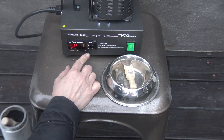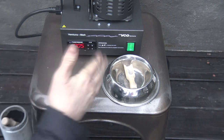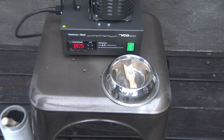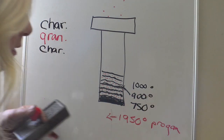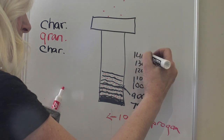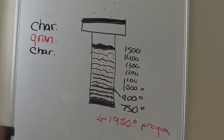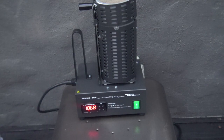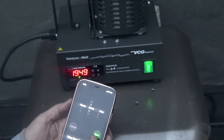We just completed our first three layers at 750. Now I raise the program to 1950 — press P and use the arrows to set it to 1950, then press P again to set the program. I'm at 806 now; I'll wait until I get to 900 and repeat the process. I'll repeat it at 900, 1000, 1100, 1200, 1300, 1400, and I usually stop at 1500. Once I get to 1500 I add that final layer of charcoal on the very top and let it sit until it gets to 1950. Keep a close eye on it and when it hits 1950, set your timer for 35 minutes.